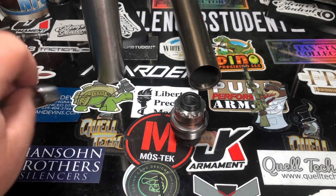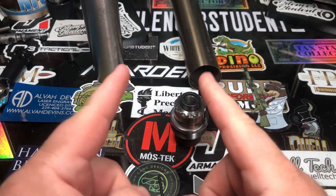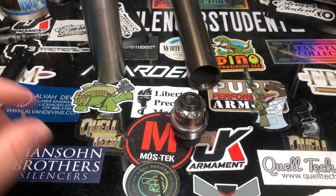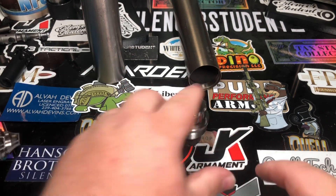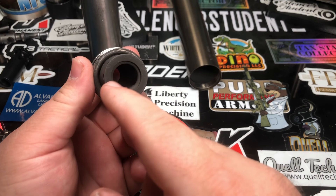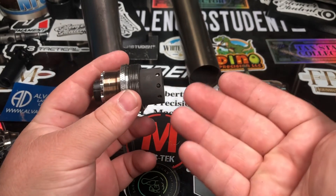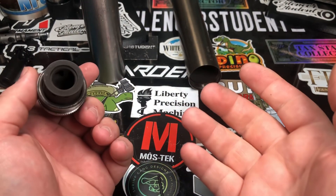The type and shape of the cone is really going to be a factor here as well. I don't know that I would recommend doing this with something like a 60-degree radial — maybe a 50 or a 40 could work — but I don't think a 60 is going to have a sharp enough angle to maintain that gap. It's also going to depend on how wide the tip of the cone is. If the tip isn't too wide, you could probably always go flush — but that assumes there's a net benefit to burying the first cone, which we don't quite know yet.